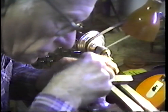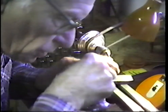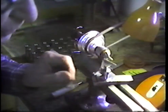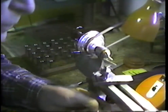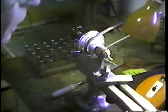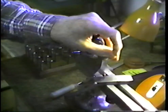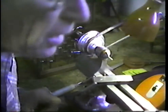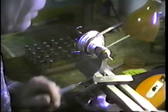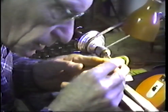I would say that this is not the thing that I would use the tungsten carbide bit for. I'll let this tool bit run onto the stock there for a moment, a little bit back, and if that had been a carbide tool bit, it would have completely shelled the point off of it when that happened. The techniques of using the two different types of tools are entirely different.